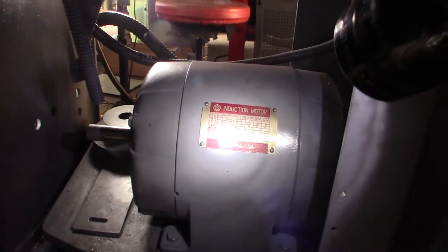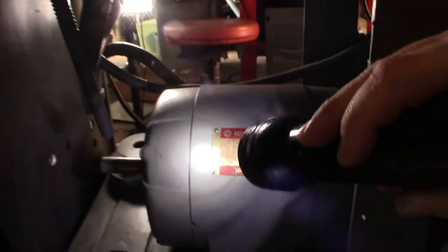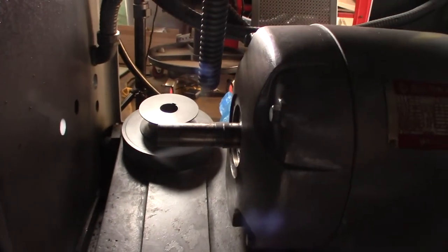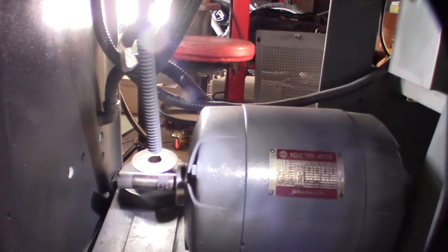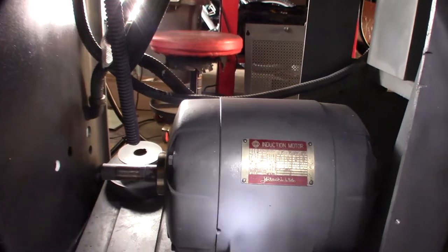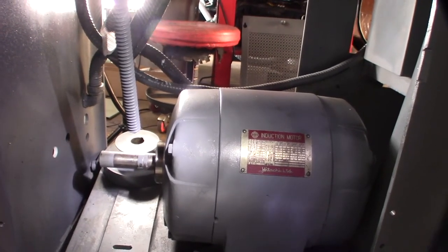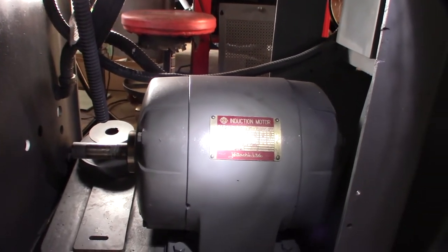The cool thing is it actually had the bearing right there on the bearing plate — it had the ball bearings listed on it. So I was able to get these front plates off and it looks like I can replace the bearings. I already took the front covers off because I tried to pack the bearing — took it apart and tried to repack it with some lithium grease, but no go. Still pretty bad. I can feel in the bearing that there's a flat spot or something wrong. But the bearings on Amazon were $10 each for a compatible bearing — same dimensions — like a 6306.